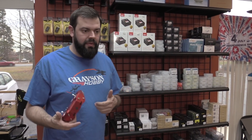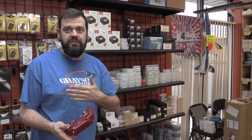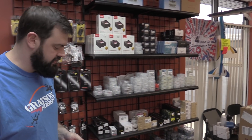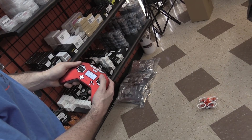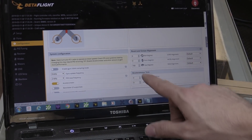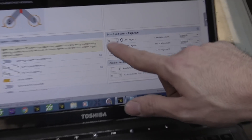You can do resource mapping by changing what pin controls what motor. The only problem is if you do that, the gyro is still pointing in its natural forward direction. So you have to reverse that by putting in a command line that reverses the gyro 180 degrees. The gyro arrow — if you take the cover off — is going to be pointing backwards. So you're pushing forward, pulling back, going right, going left. The command line I ran changed the yaw to 180 degrees on the board and sensor alignment.